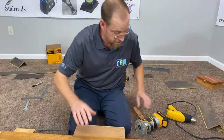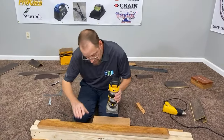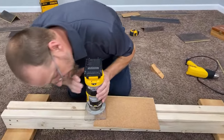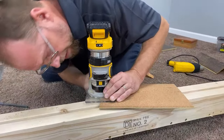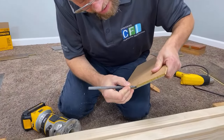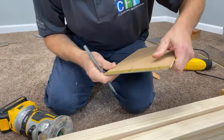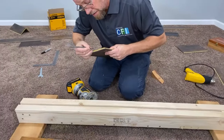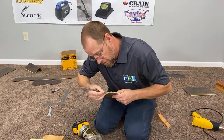So that's the only thing you really need to watch for. I'm going to take my board and get it right where I need it. I'm going to mark this line straight down so I can see it on both ends, then adjust and set my router exactly where I want it on both marks.